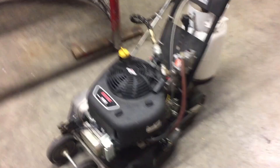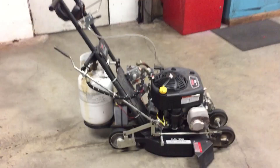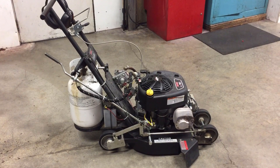What we have here is a Thompson Ice Edger — this is a Pro-18, which I'm pretty sure stands for propane. This is Thompson's standard propane edger. There's also a gasoline edger as well as an electric edger. Zamboni makes its own edger, Olympia makes an ice edger, and there's a few other companies that make ice edgers. Even though they all look a little bit different, they all do the same thing, which is edging the ice. So what this ice edger does — it notches an edge in the ice along the boards where the Zamboni can't get to.